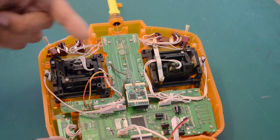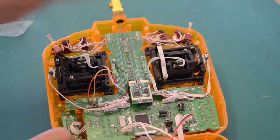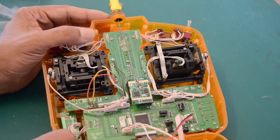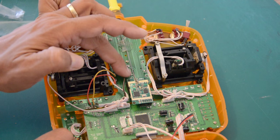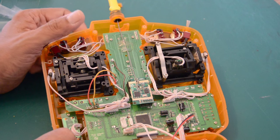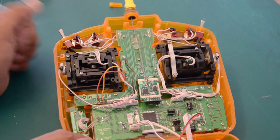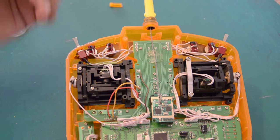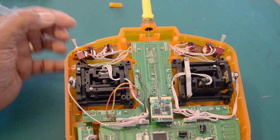The antenna is a coaxial antenna, meaning it has an inner wire and a sheathing over that — it's very thin. While I was doing this repair two nights ago, because one of the leads had broken loose, I accidentally ended up soldering both the inner wire and the sheathing together to the same connection. So my range became very limited — without realizing that, I went out to fly without doing a range test first, which is what I should have done.